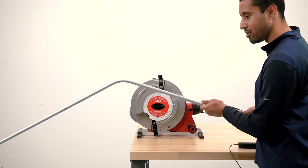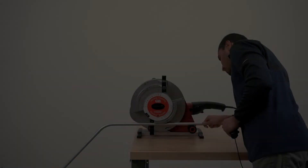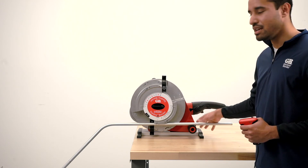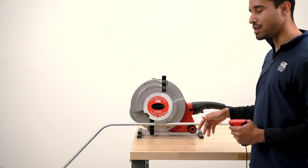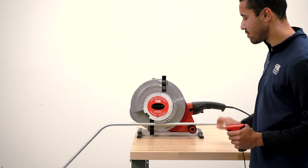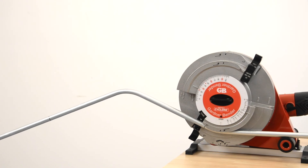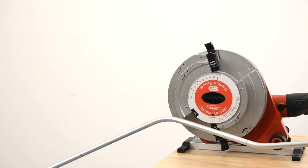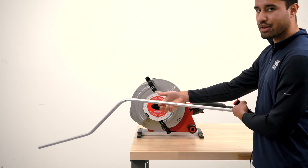Once I have that 45-degree center bend, I flip the conduit over and line the outer marking with the arrow rather than the rim notch, then do a 22.5-degree bend. One advantage of the portable cyclone over a hand bender is you get tension as the conduit locks in, which you can use to rotate the conduit and make sure it's all in one level plane so that when all three bends are done you don't have a wobbly piece of conduit that isn't straight. Then flip again and do the third bend, lining the marking up with the arrow once more.